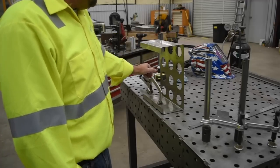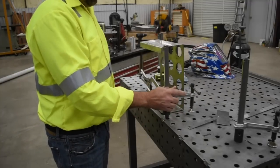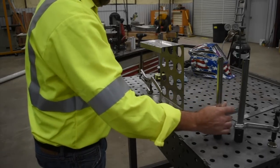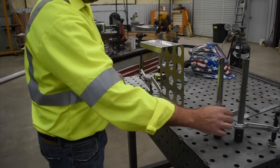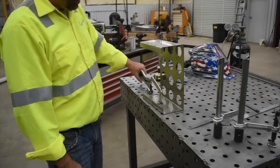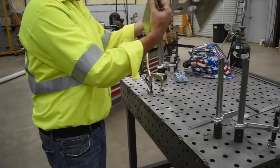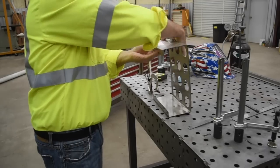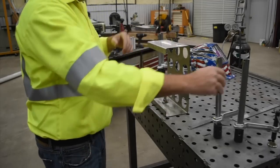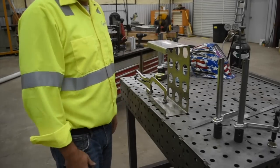So Reed, as you can see, we're putting these to work. You guys know that we've got this style inserter clamp. You can see that is already a problem right there, where that's too tall to fit. Sometimes you need a longer reach. I think these only have a 4-inch reach. These are 6 1/8. And then there's the quick adjustability of the vice grip style clamp, so that in a second you'll see me flip this over to cut the other side. It'd be really quick and easy to pop them back in there and then zip the other side, rather than having to twirl and untwirl and position those. So Reed, thanks again. Appreciate it.